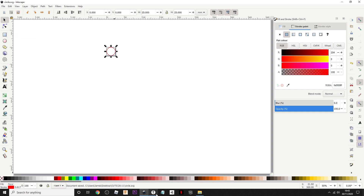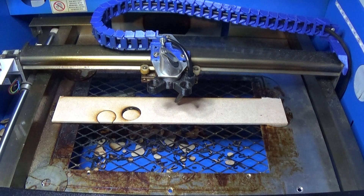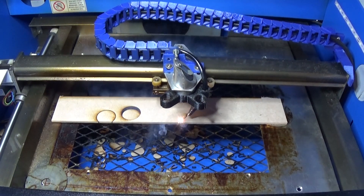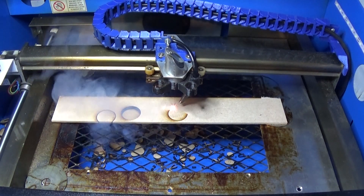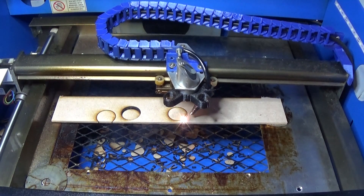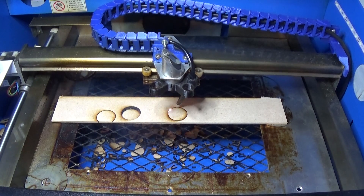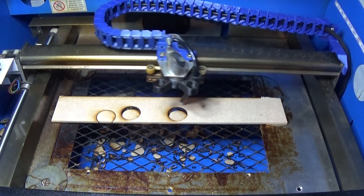Go back over to K40 and press Reload Design. That's it. I've moved the laser up a bit and all I need to do is click cut once and it will do it all for me. It will go round and when it gets to the end of its initial job, rather than going back to the start, it will just carry on and do a second cut. This really does cut down a lot of time if you're doing certain files. Job's done.